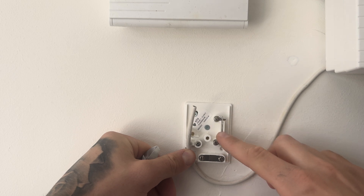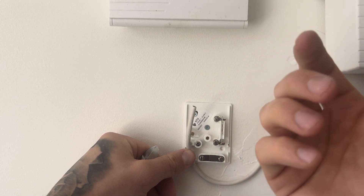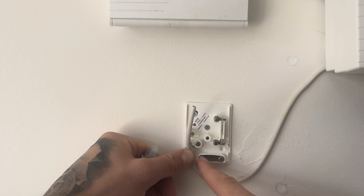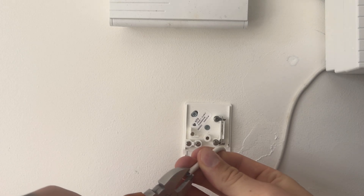The terminals on the right are the alarm terminals, so you'll have a blue and a yellow that go into either side of that. When the device is pressed it will trigger the alarm. Down there is a butterfly contact — if you have a tamper circuit on your system you'll put one leg across either side of there, in our case being the green and white cable. This means if someone tries to open the device it will send an alarm.